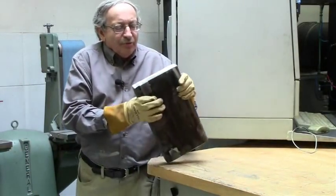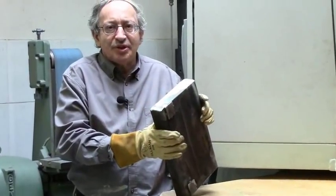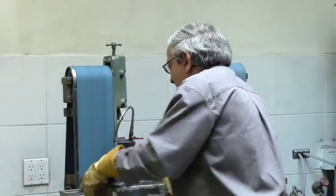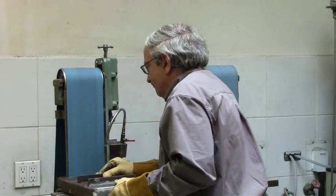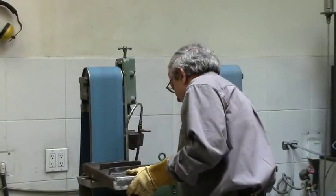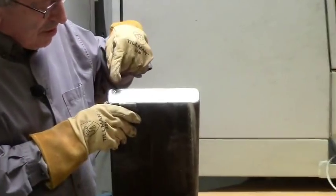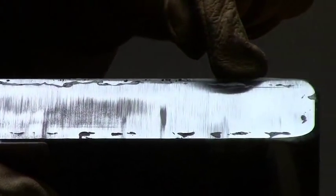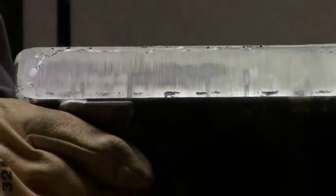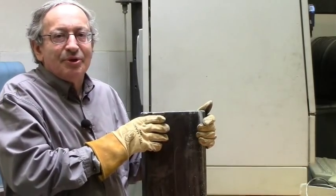Okay, so now we let the melted powder cure for about a minute or two, and then we let the whole thing cool down. Now once it has cooled down, we just sand it and all the defects will be filled out. Okay. So now what you can see is the white powder, which melted, only stayed where there were dents. Obviously you're going to do it with the same powder you're going to coat it with, because this way you guarantee there will be no color show through.